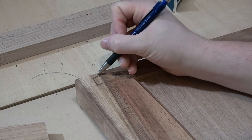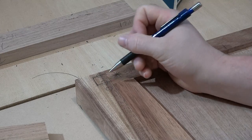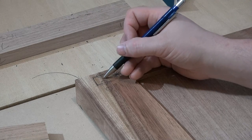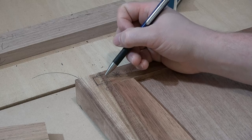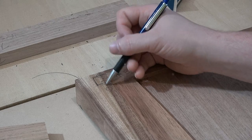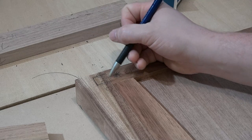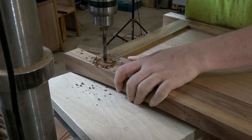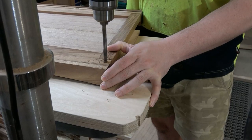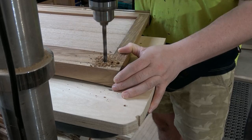So instead, if I use three dowels, one about there, one about there, and one about there, these two top dowels actually drill through that tenon, but it still leaves enough bulk in that tenon that it's still good. And instead of cutting the tenon in half, it simply pins that tenon, so that even if this glue was to fail through here, this couldn't pull out because those dowels will be stuck through there, and it'll increase not the strength, but the durability of the piece.